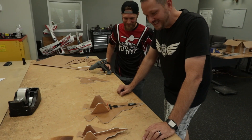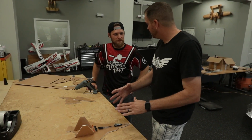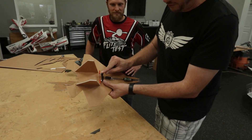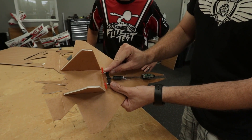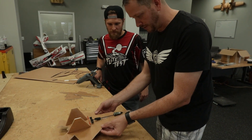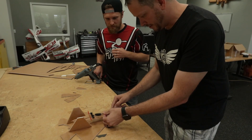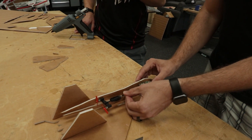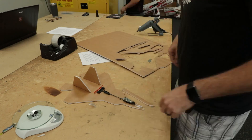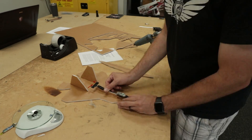It's just not happening — there's no way. But now that we know the reality, we know this is like a pretty nice speed. We can see the glide in a gymnasium or in a backyard. The foam is gonna take up a huge amount of efficiency here. So what I'm thinking we're gonna do next is mark where our center of gravity is — right about there. Look how perfectly that lines up with the canopy. I'm just gonna start hacking some foam together, stick this on in its roughest form, and then we're gonna see it fly.